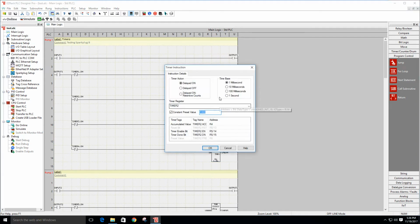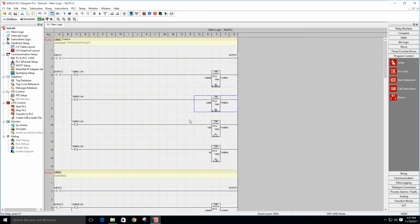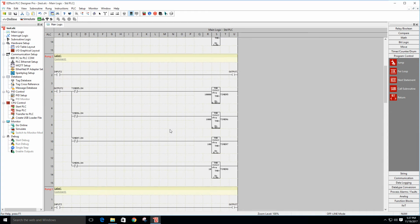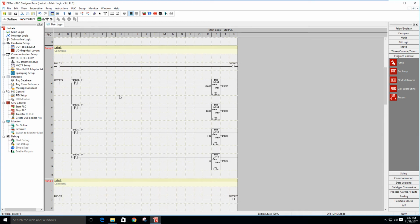And I actually didn't mean to do that. I meant to do that in 10 millisecond increments, but I'm not going to make any changes now. So what we're going to do is my benchmarking code is going to come in, and one at a time we're going to turn on the group of timers, and then track the number of bytes that are sent over the wire, and print what the payload was over a set amount of time per second. And then we'll start group 2, so it'll be no groups, then 1 group, then 2 groups, then 3, all the way up to 5 groups.